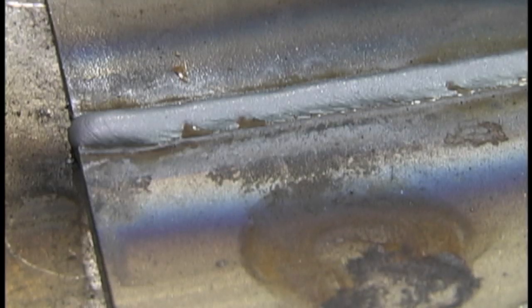Here's the square groove weld. I'm doing a little zigzag motion, playing the light. I probably wouldn't normally do this, but for the purpose of the Scout merit badge it's probably a good idea if people are really new to welding. This is just a straight line, and here's a straight line with a small gap in the metal, which is probably the way it would be done in real life.